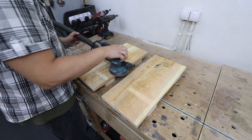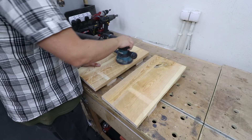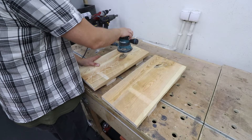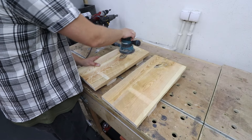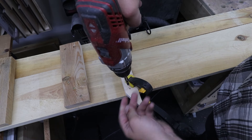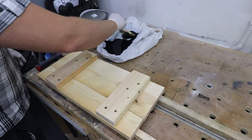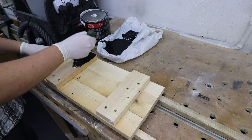With all the sides, fronts, and backs now connected into those larger panels, I'm going to sand everything down just slightly — just to break the edges on all the boards and to get rid of any splinters, to achieve a more or less smooth surface. However, I'm only going to do that on the outside perimeter; on the inside I'm going to leave it as is.